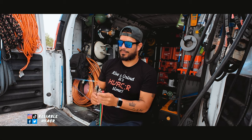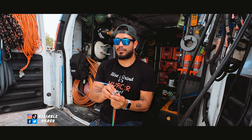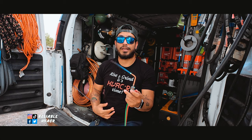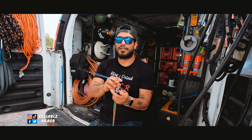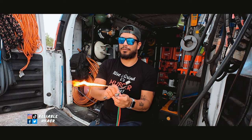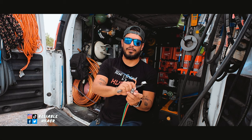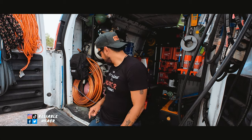Quick tip: if you're indoors — commercial or residential — crack open your oxygen just a tad, then open your acetylene. That way you already have a flame going. It gives off a pretty good flame and it should be nice and quiet when set correctly. If it's screaming, it's not set right — adjust it and you'll learn. It also helps it heat evenly; if you're starving one side it won't heat as it should. If you haven't done it before, light it and find that point between throwing smoke and not, then introduce your oxygen and adjust accordingly. You want a big flame, and if you turn both off at the same time you get a crack.